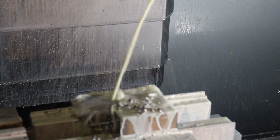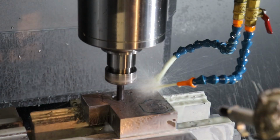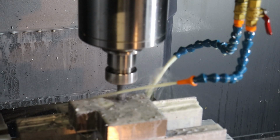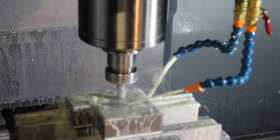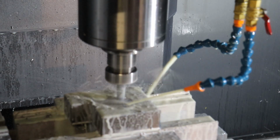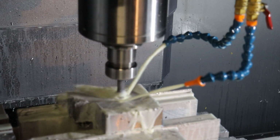So this is the roughing end mill. I still got everything kind of slowed down from that big drill. So now we're going to plunge straight down in the quarter inch pilot hole. And get rid of that ring. I reduced the RPM down to 1300 and a feed rate of about 3 inches per minute. I'm gonna get some more flood in there. So that sounds healthy. Let's go ahead and interrupt so we can see what's going on.